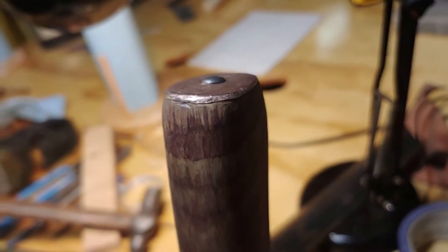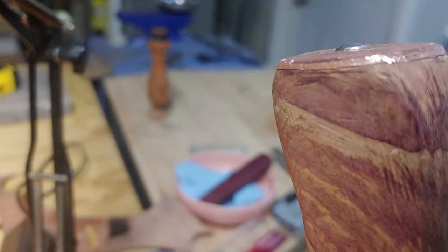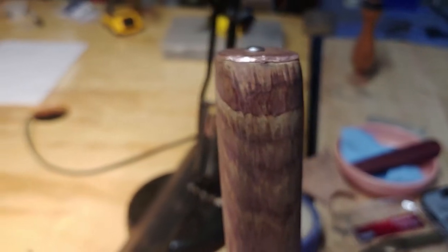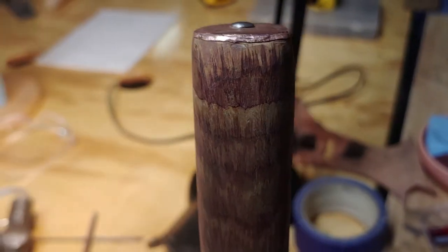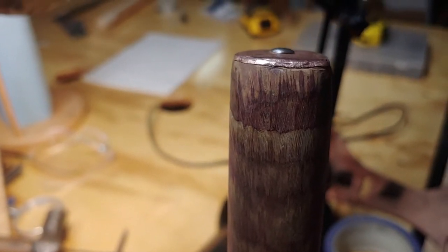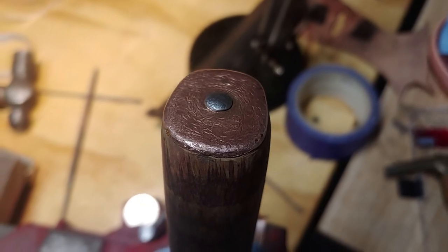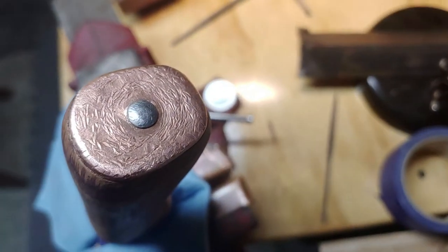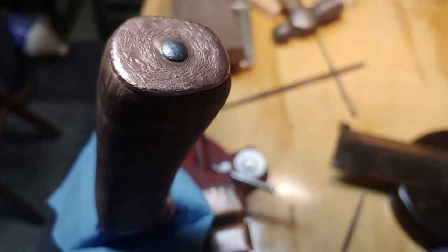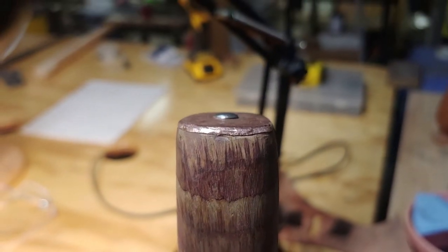So as you can see, there's a little bit of a gap at the bottom right between the handle and the bolster. I'm going to get that out — I was not able to hammer it down enough and file it flat. What I'm going to do is a hybrid fit-up where they both come into a little V or U, so it's a really nice transition between the bolster and the handle. I really like how the rivet is coming — I added some texture on the back plate to complement the little bit of accidental texturing I did with the hammer. I just embraced that and continued on that little motif, and all in all I am super pleased with it.